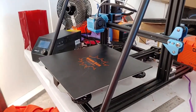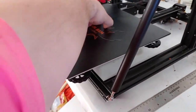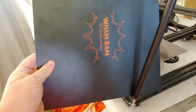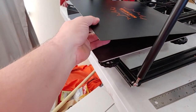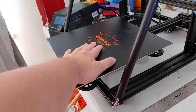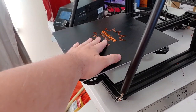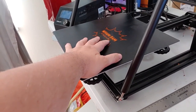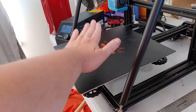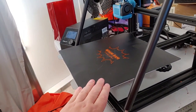The last major upgrade I made to my CR10 V2 is the Wham Bam flex plate system. I will never go back to non-flex plates if I can help it. It's so convenient — just pop the plate off, flex it, get rid of the print, pop it back on, and you're ready for your next print. This is their polycarbonate PC sheet. I use it because I can turn off the heat bed — it does not require heat to stick. I turn the heat bed to 60°C, and at layer 20 I turn it off, so I'm not burning electricity for the entire print.